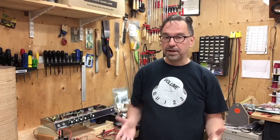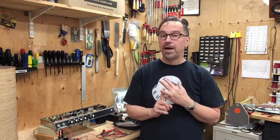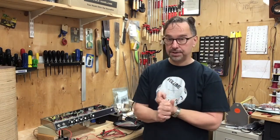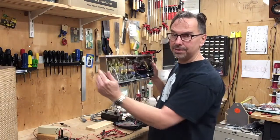All right, I think we're done tweaking. We've tweaked cathode capacitors, cathode resistors, bypass capacitors, grid stopper resistors, and grid leak resistors. I think the amp is as tuned as it's going to get.